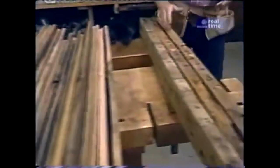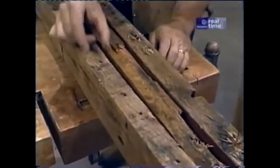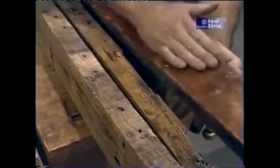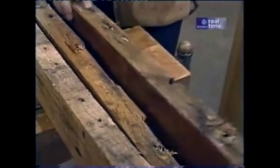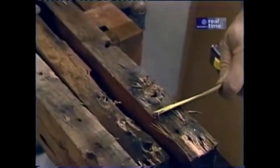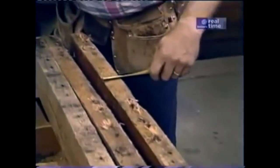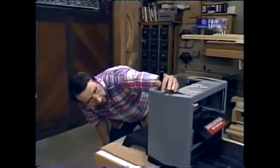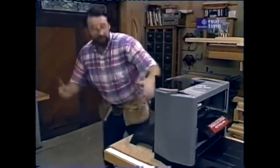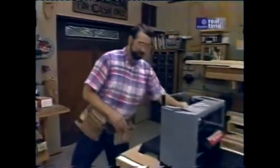The idea is to clean all this wood up. I'm going to start with these three pieces, which I want to all end up at a uniform thickness. So I'm going to surface plane the broad surfaces. I'll take a measurement to get an idea of roughly how thick it is — it'll vary. Inch and eleven. Inch and eleven. Inch and three-quarters. So it's always better to set the planer a little bit higher. I'll go to inch and thirteen-sixteenths and take nothing or very little, then keep adjusting until we remove material.